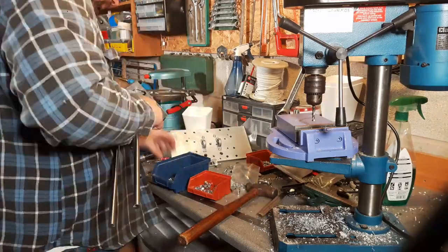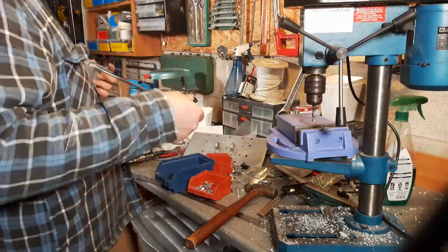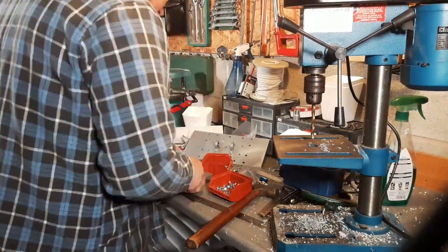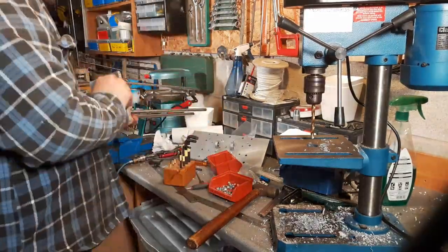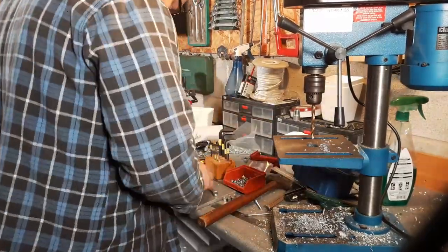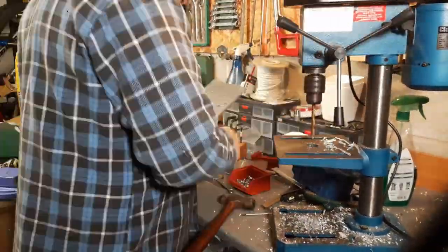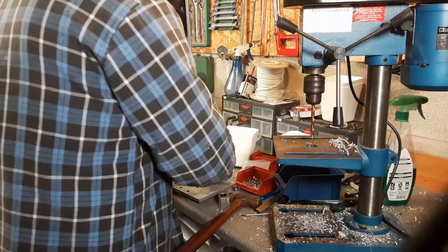I used the persuader a couple of times. When you're doing these things manually — I really didn't want to go through the CNC mill process as this is a prototyping exercise — tolerance build-up is a real problem. You can drill holes you think accurately, but you end up having to re-drill holes sometimes a couple of mil oversize just to get all the bolts to line up, especially when you're relating four or five different holes. Quite often I'm going back in and opening holes up through that prototyping process.